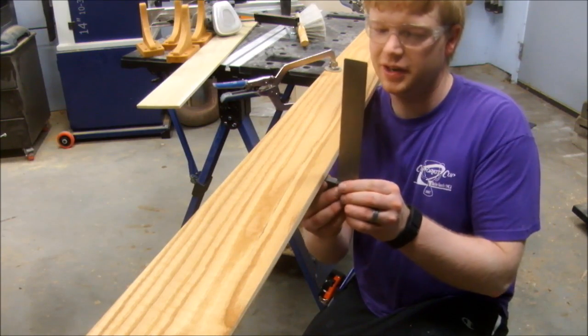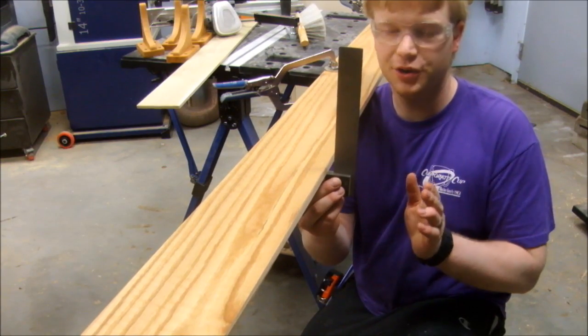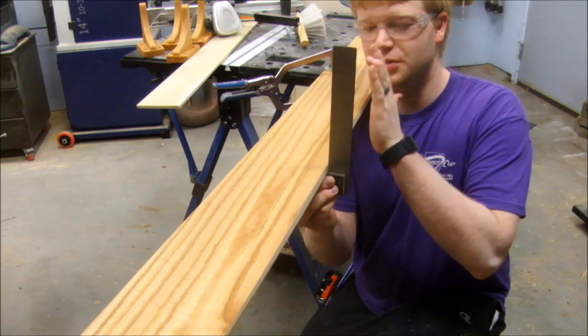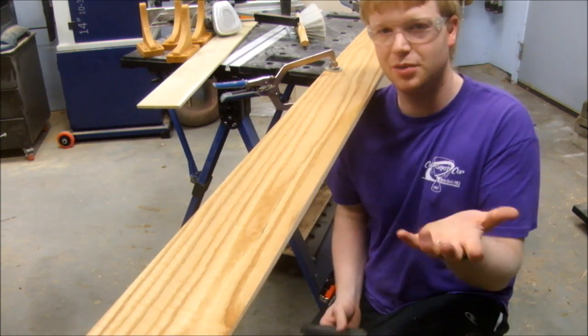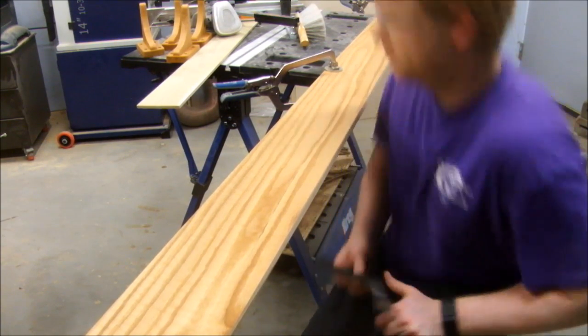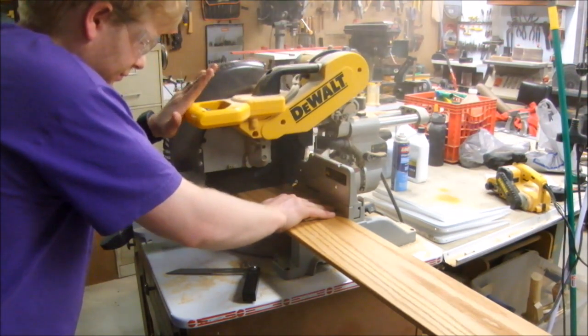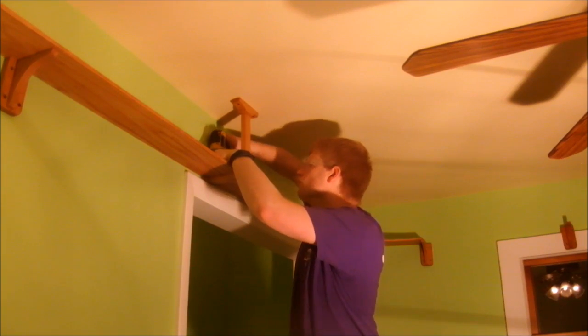I sanded over to my line and I had a little trick with the belt sander. It's hard to hold it a perfect 90 degrees, so it's going to be off. I'd rather have it be slightly beveled to the top side — that way, from the bottom, you'll never see anything. After shaving the board, I can cut it to size at the miter saw, and then I'm drilling and screwing it into place.